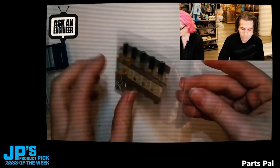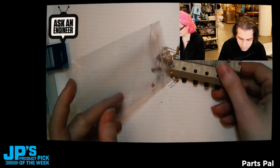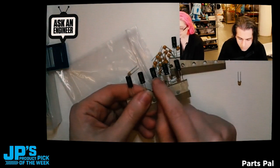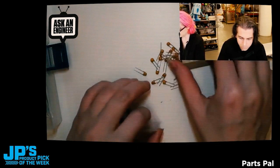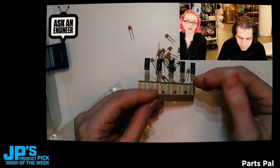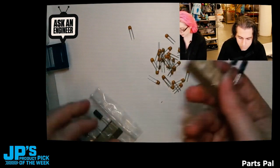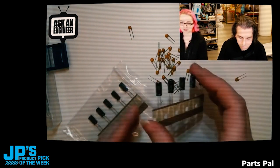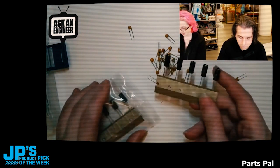You also get a bunch of capacitors. These are really handy because you can get resistor kits, but capacitor kits are rarer. So this is 10 microfarad 50 volt. So that's one set, and you get 5 of those. You get 5 100 microfarad 16 volts. So of course, the lower the capacitance, the higher the voltage. It's usually a trade-off. So if you really need high voltage, use 10 microfarad. If you are using everyday voltages that most makers use, the 100 microfarad will work fine.